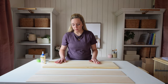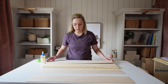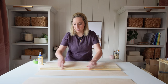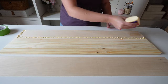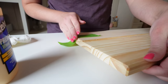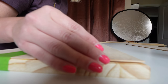I sanded down all the wood filler — it turned out really nice — and now we're going to attach our basswood pieces, all cut down to size, onto the drawer fronts. We'll line these up with the bevel edge that's already on the drawer fronts; that's a perfect guide so we don't even have to worry about measuring and positioning. We're using some basic wood glue and painter's tape to adhere everything in place until it dries, about 20 to 30 minutes.